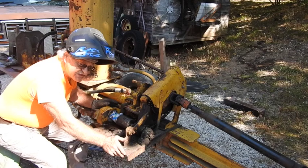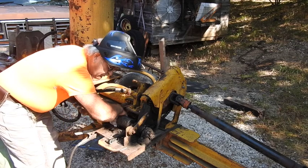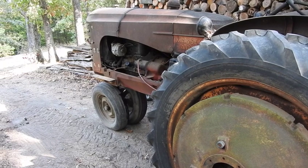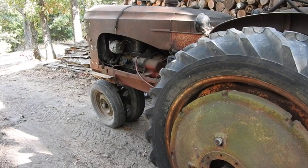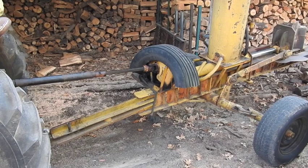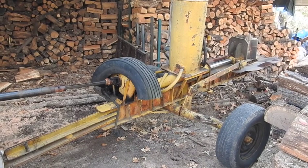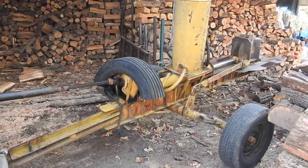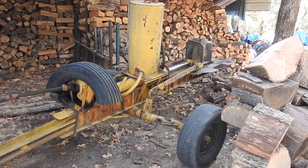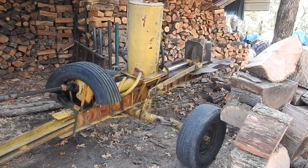Now that's not one of my most stellar repairs, but it's farmerized at its best. It got a little uncomfortable to the touch, but hopefully not up at the seal. We're going to go ahead and try out that repair job on the wood splitter. I'm going to power it this afternoon with this old Massey Harris Model 30 — it's about a 1950, maybe a 1951. It receives its power off the power takeoff, so it's going to be turning 540 RPM, but the gearing off of an old field chopper increases the RPMs to around 3,600 to run that single stage pump. You can see the arm on the push block — that's going to allow us to lower the beam to whatever level I want to work at, put a block underneath it, take the arm off, and go ahead and work. It's fully adjustable in that respect.